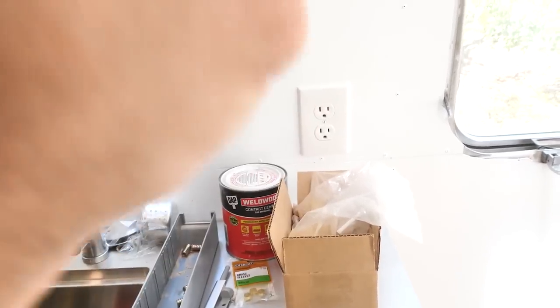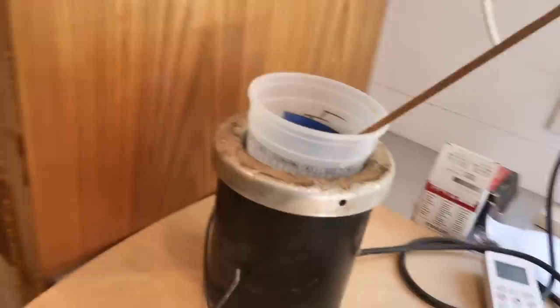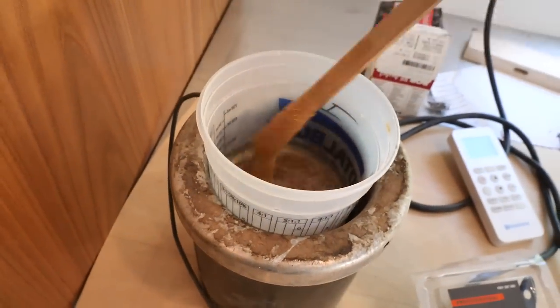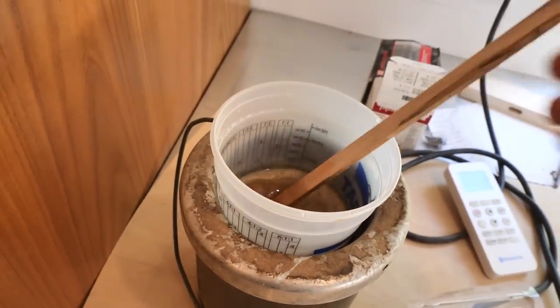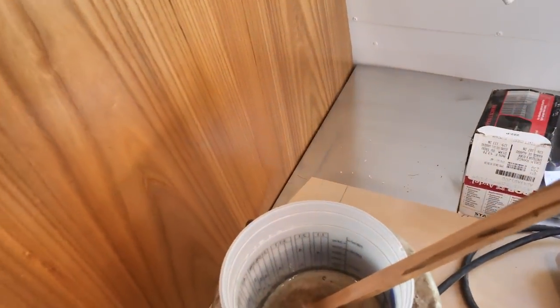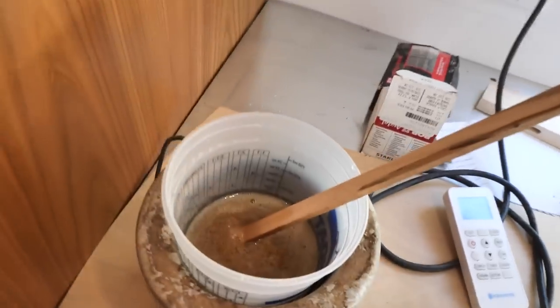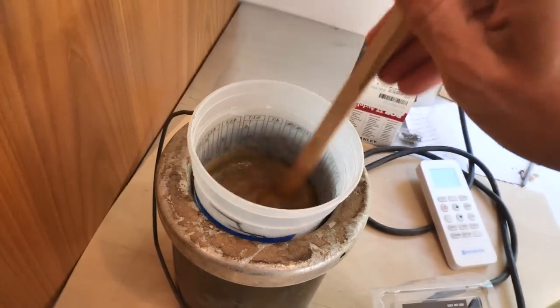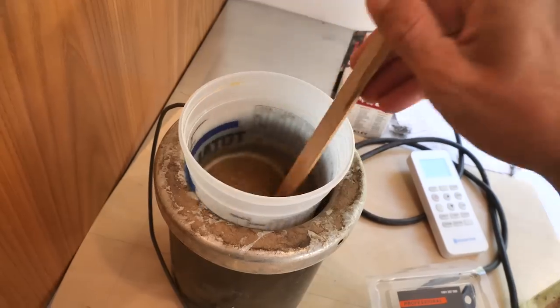When I first started furniture making, I did an apprenticeship in Berea, Kentucky, doing chair making. We made ladder back chairs, and we had a glue pot just like this all day heating up glue. We glued all of our chairs together with hide glue. The great thing about hide glue is that it is reversible. All you need is heat and moisture, and the glue reverses. All of the old school antique furniture back in the day used this glue. It is a really good glue, super versatile.